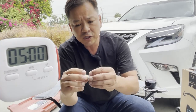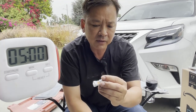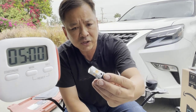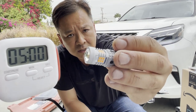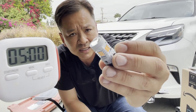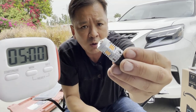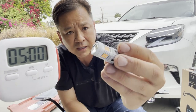Originally, what we're looking for is the quality of a light bulb. If you're buying really good high-quality light bulbs, they're made out of really good aluminum housing, and what you're looking for is a lot of these fins. See a lot of these fins? These are what's used to dissipate heat. You want a design where heat dissipates greatly over the whole entire area of the housing. You don't want heat buildup because LEDs do run hot.